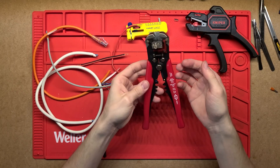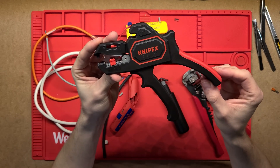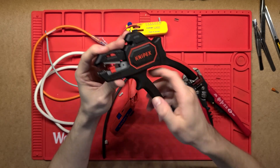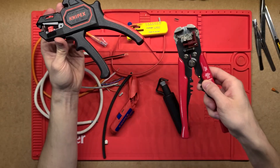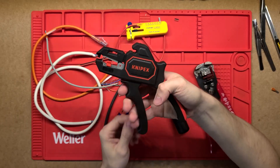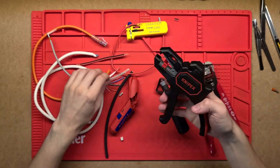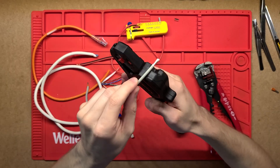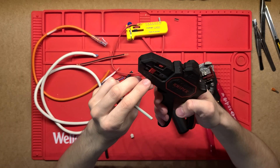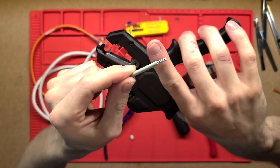The drawback is it probably is the heaviest and quite bulky in size. Moving on to this one — obviously the grip is completely different. The casing is all plastic, a glass-reinforced plastic, so it is quite nice and sturdy, whereas the previous one has metal on the bottom. This one here is a lot lighter. The grip is really nice — you just hold it, pull this lever forward, it clicks in, and it'll strip it. It also has a cutter up the top here, so you can put a cable in, cut it, and it just chops it off — really nice and clean cut. Then you put that cable in, hold it, strip it, and nicely done, nice and quick.